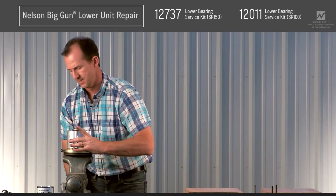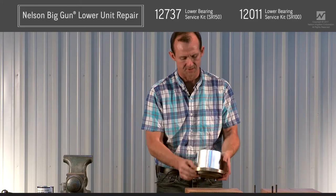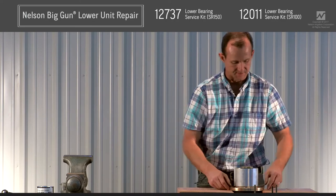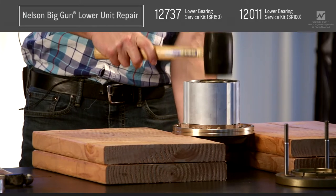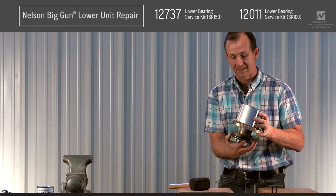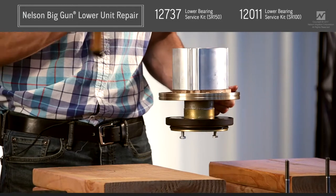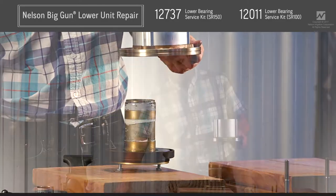Set the retainer nut aside and take the rest of the assembly. The top piece is now free to slide out, but it will need a little help — it needs to be tapped out because there's a slight interference fit between the bearings and the main stem. Stack up a couple of boards to support the brass ring called the cover, and tap the stem out. Work it slowly through that second bearing. If you're in a hurry, you can use the ball-peen hammer and tap down on the stem to get it through the next ball bearing.